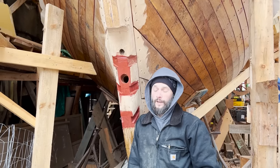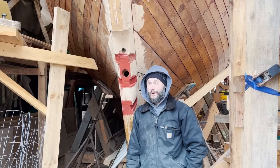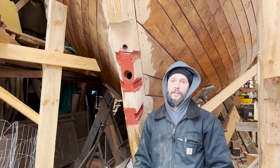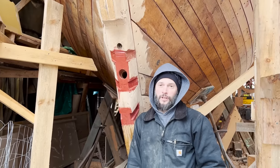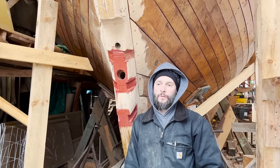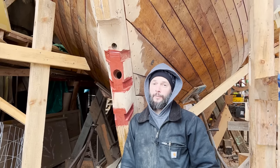Because this rudder is so heavy and there's 3 pintles and gudgeons that you need to line up for it, I would really love to just leave it on the boat. The rudder can stay for a long time, but switching out the bearing that goes in here, the little rubber cutlass that the shaft rides in, you have to do that somewhat regularly. Every handful of years, the prop should get maintenanced and serviced. So it's got to come off for those times. That is why that hole is kind of grotesque right now, and it will be fixed and it will be pretty and it will be easy to take the prop off in the future.